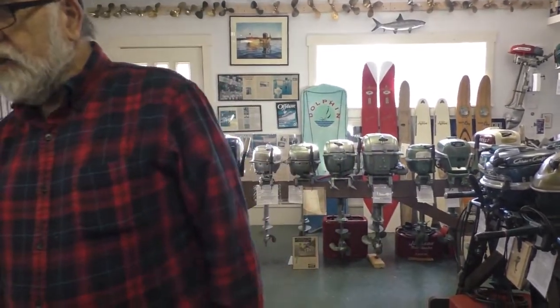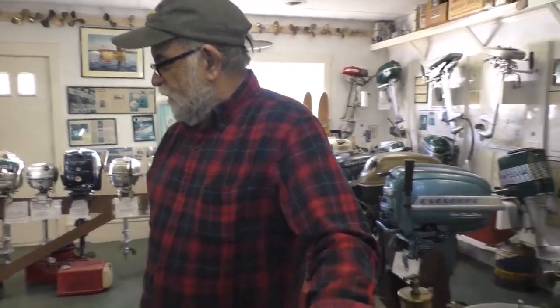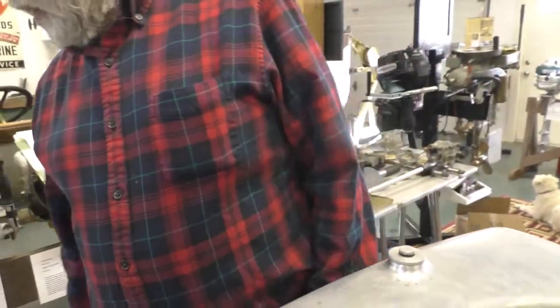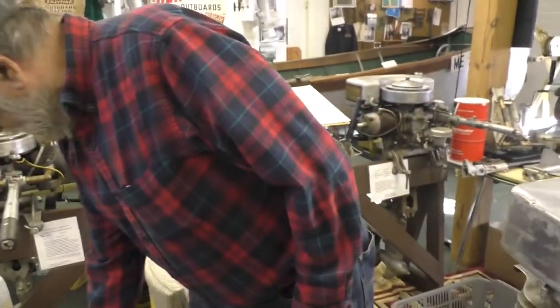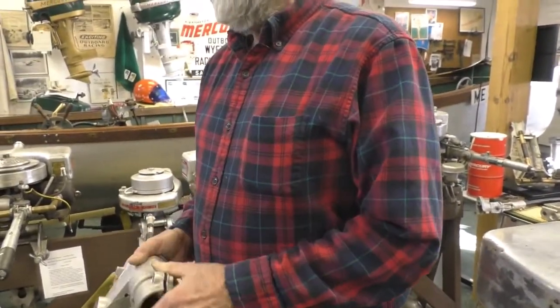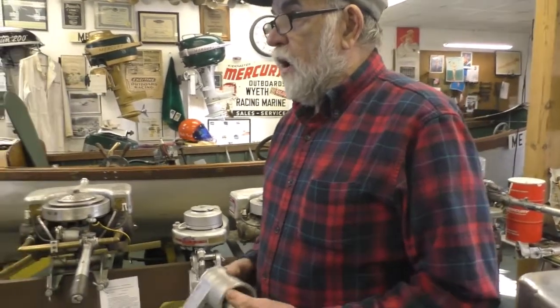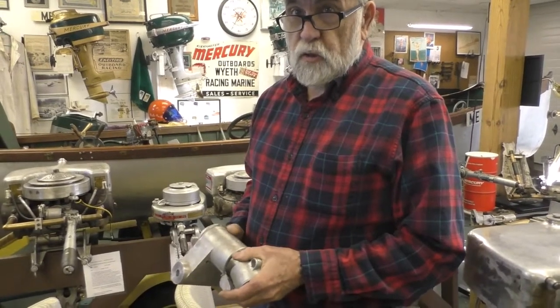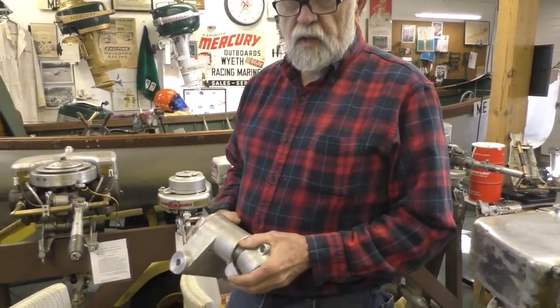Other repair techniques, of course. Why don't you take some of your horses and shoot them and use their bones, and then you could rehardened them. Sure, good calcium carbonate or whatever. Isn't that how they did it? Didn't they harden it in cyanide, in bones, calcium? It's a cyanide hardening process. Didn't they harden them in charcoalized bones, I think? Well, you can do that too. You can carburize with carbon and introduce it into the surface of steel. That's another good case hardening technique.